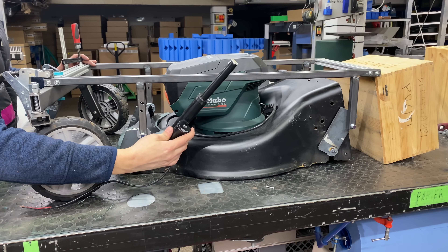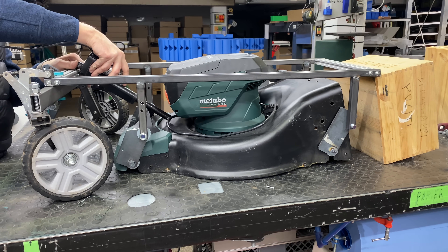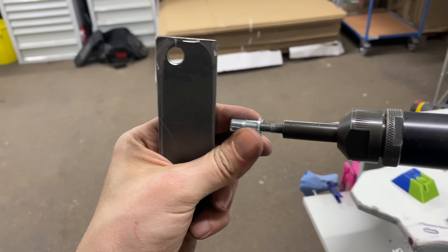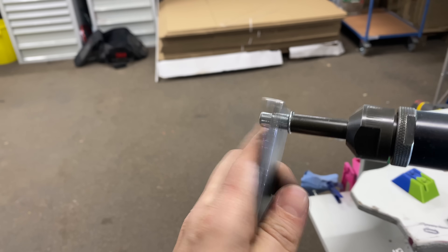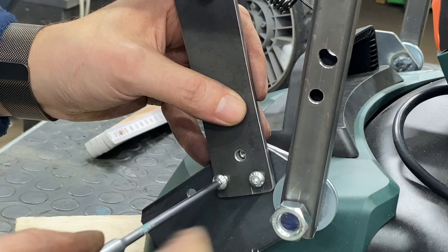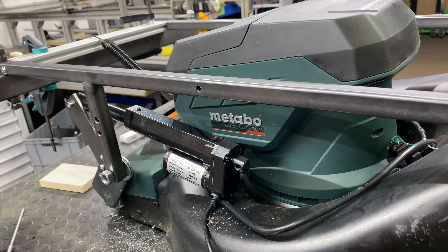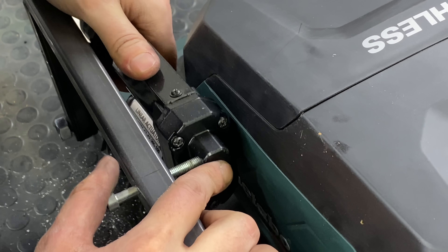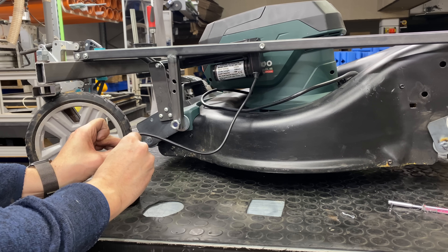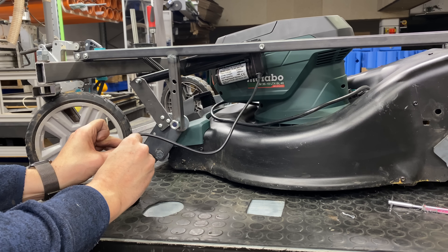To actuate that I've got this actuator — it runs on 20 volts and it just pushes in and out and I'm gonna add that somewhere here. Adding threads to the steel is always a good connection and easy to assemble. Here at the top of this lever I'm using a rivnut — a rivnut set-up from Josipa, it works really well and it's very easy to make nice threads even in thin material. It was important to install this height-adjusting motor now because then I can lower and raise the deck easily without having to hold it with my hands, and find out if the front wheels are in the right location or not.